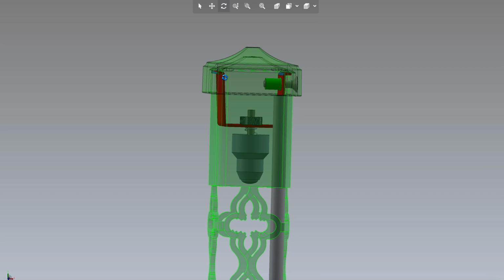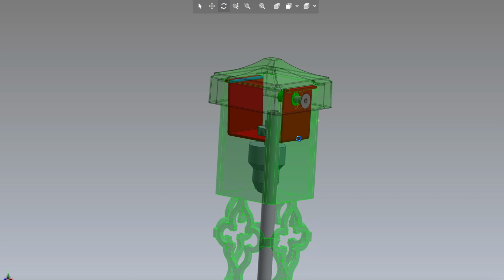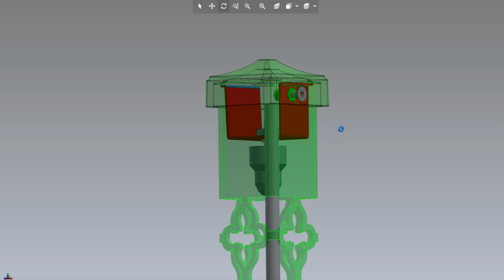This is going to be an anodized aluminum socket holder, LED module holder. It has a clinch nut here for the top screw to hold everything in place. This is easily removable, so there's little ledges here or bends in the metal to hold it on top of the 2x2. The 2x2 Bollard tube itself has little notches, so this socket holder or LED bracket holder does not interfere with the top cap going on.